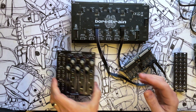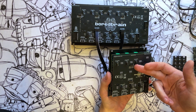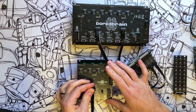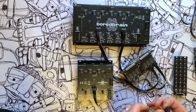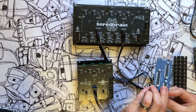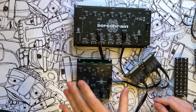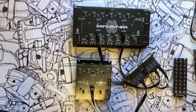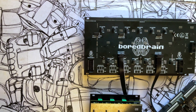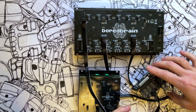In this case, we're going to use the XP3 channel expander, which has two identical connectors on the back to connect the direct outputs - pre-fader and post-fader - for channels seven through nine. Since it's exactly the same, we'll just do the same thing: plug this one in and it comes out here. We still have one free, so we could use another channel expander - a second XP3, the upcoming XI3, or on the mixer itself there's actually one more direct output header for the two stereo returns and the main mix out. So we can plug that into the fourth connector.